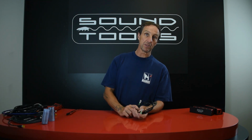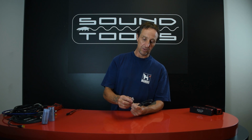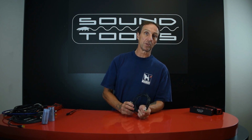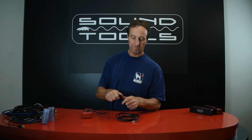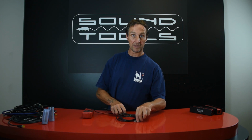Even if the cable is shielded, if the connectors are not the proper connectors and do not have the metal housing, then the shield will not be utilized and connected. And we can see that. Here's one that's just got a plastic housing. And if we take the multimeter, obviously plastic does not conduct to plastic.